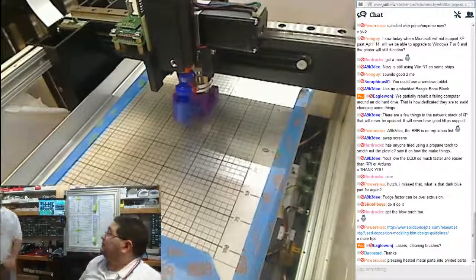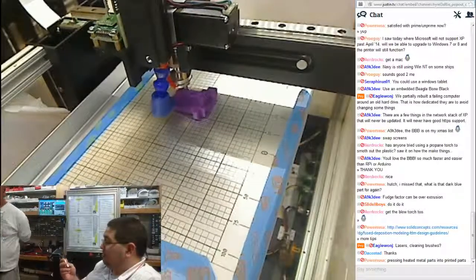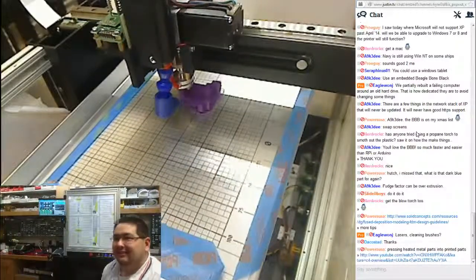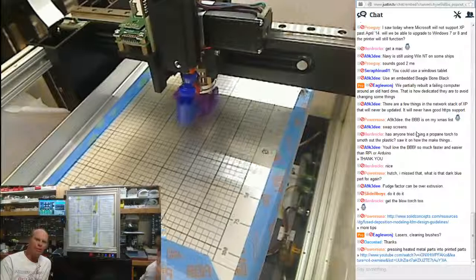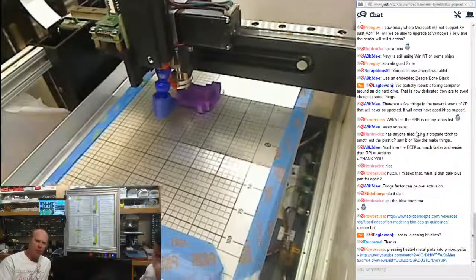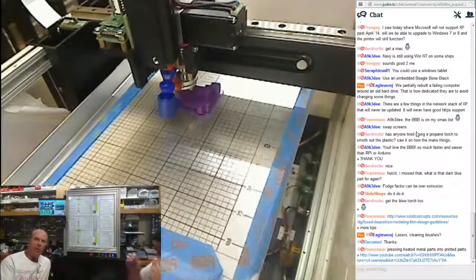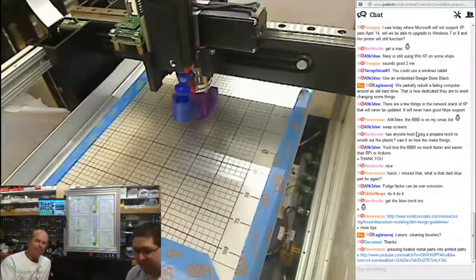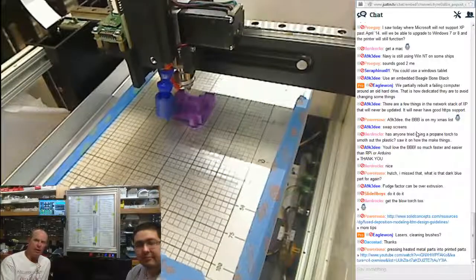So, last two questions are from Eagle1J about lasers and also the cleaning brush. We have the 1 watt, 3 watt, and 8 watt lasers in-house. We are working on an isolated drive circuit because lasers have a negative polarity, meaning that the case is usually the positive side. So you have to invert the power supply or come up with a second power supply that's a negative power supply. And it has to be constant current to run these laser diodes without hurting them.